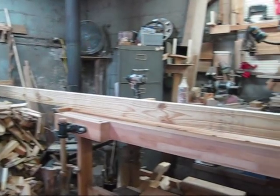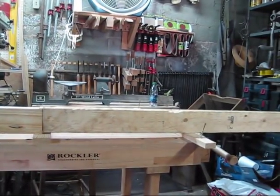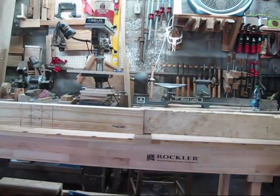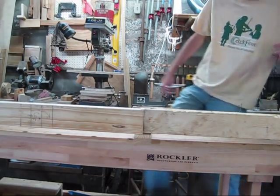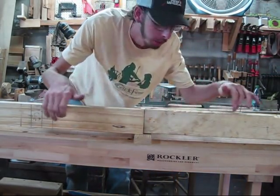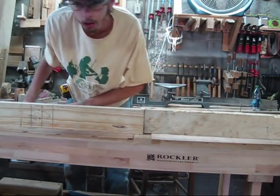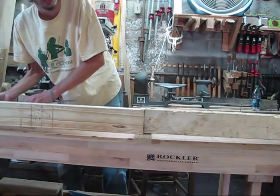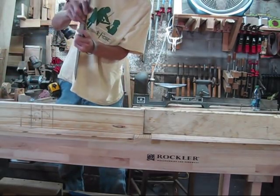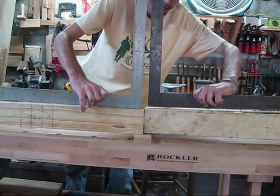This here is another trick that you'll see in construction a lot — well, maybe not a lot, it's a little less common. But you will see it in pipe fitting and others as well. It's the old square trick to check if something's parallel. I've got these two beams right here and they look parallel if you saw the pan I just did on both of them. They look like they're in the same plane as each other. But you take your two framing squares and put them right here where they join.